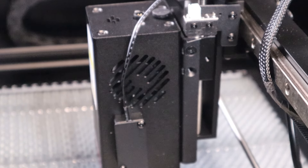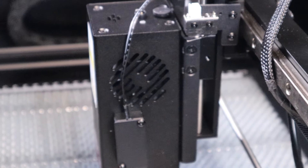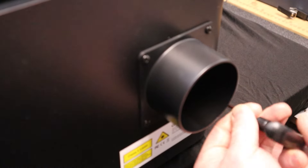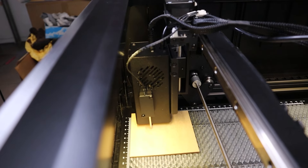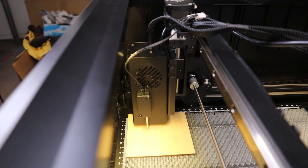The assembly of the machine was pretty simple — it just took a couple of screws to mount the laser head onto the gantry, although the instructions are really sparse for how this thing goes together, so anybody buying this machine without much experience might have a little bit of trouble. The one unique thing I noticed was that when mounting the laser head onto the gantry there is one thumb screw, and the placement of that thumb screw is really important because it's what actually triggers the limit switch as it goes up and down. Other than that, assembly is maybe 15–20 minutes. There is some additional setup needed in LightBurn, mainly for setting up the autofocus on the laser head and also for an additional 2mm offset when cutting.